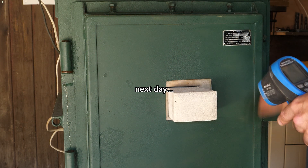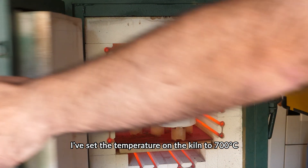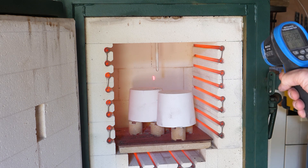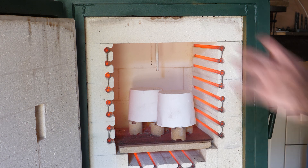So this is the first time I've used my renovated kiln, so I'm keeping a very close eye on the temperatures. I need to get it hot enough to completely burn out the PLA plastic moon patterns, but not so hot as to destroy the delicate molds. 700 at the back, 610, 615, 630. I think that's hot enough.